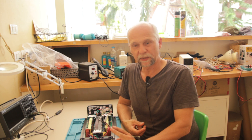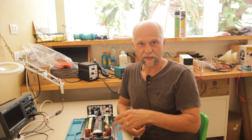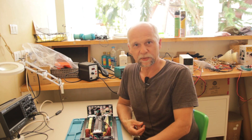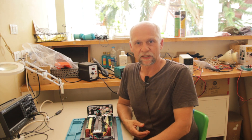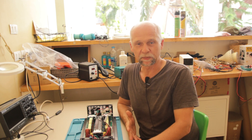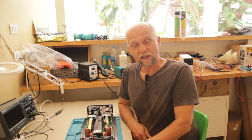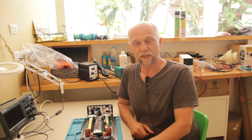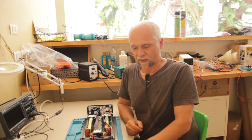It then blew up again while I was not here, about two weeks ago. I made a repair attempt and even filmed it, but when I was finished — the standard stuff, replacing IGBT driver etc. — unfortunately when I plugged it in to test it the camera was not on again. As soon as the inverter synchronized to the grid it just popped the breakers again and the IGBT instantly blew out.